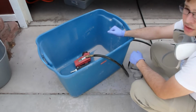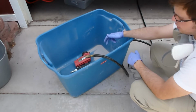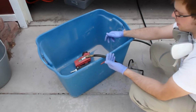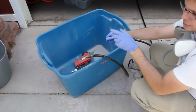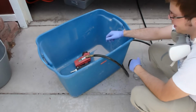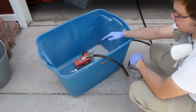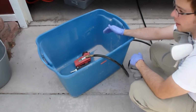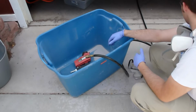KG Industries recommends about 20 psi, but I think because of the gun that I'm using, rather than a regular sandblasting setup, the 20 psi doesn't really work that well, and it kind of just gently throws the media at the metal. So between 30 and 40 psi is really what's working. So I'll sandblast some stuff, show you, and we'll move on from there.